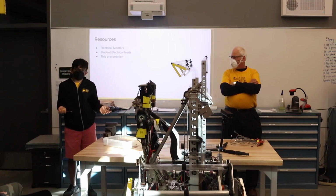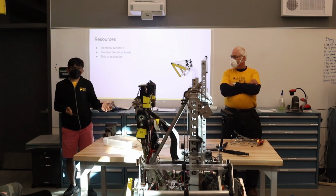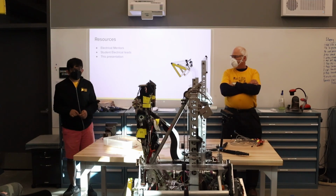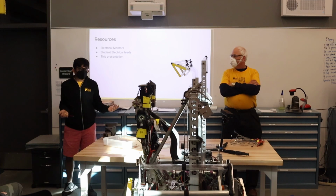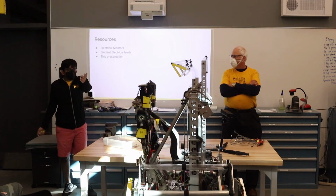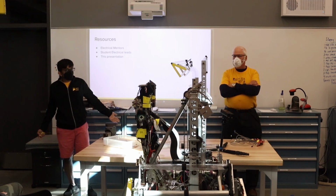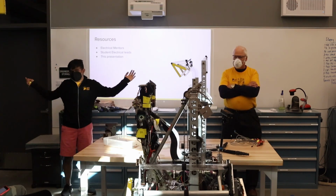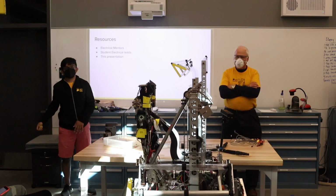Right now, we just use the daisy chain. We haven't had any reason to do anything more complicated than a daisy chain. We don't use any CAN hubs. Yeah, we have one termination resistor at the end. The one special thing that we do is we have a status light at the end, and if that isn't on, then we know that our CAN network isn't working. It helps because if there's only one thing at the end, then you know that if that part's broken, everything else is broken.